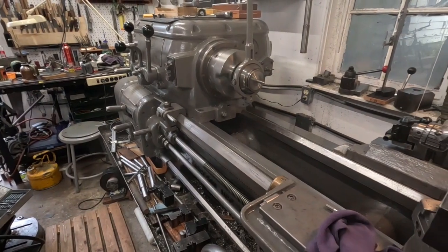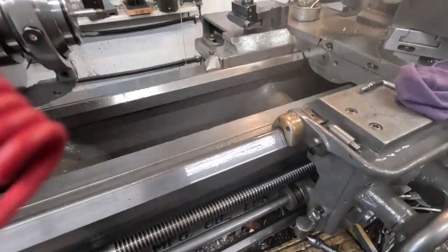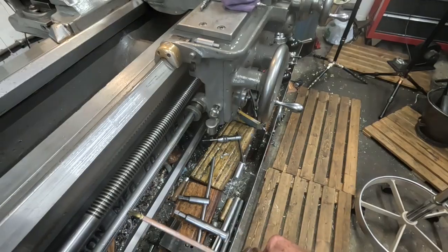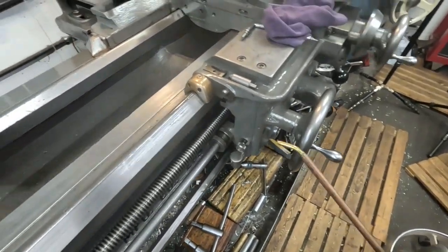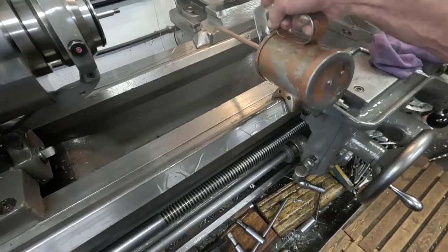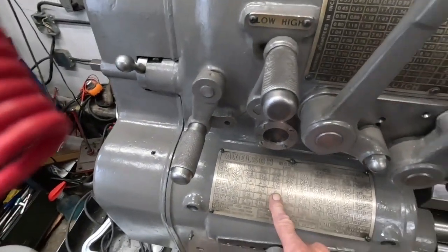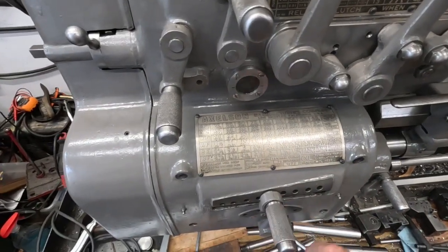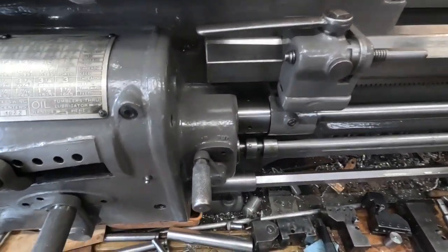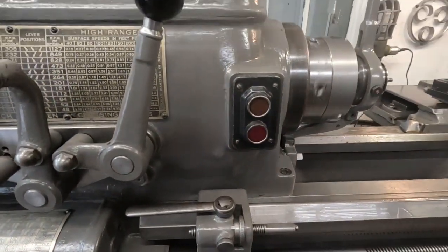Got this old machine oiling up on its own, and it needs a little bit of help too. I squirted a little oil on the lead screw and just a little bit of everything else that slides. The ways are oiling good, but I'll give it a little bit more — be sliding the tail stock in there. So I got this set here at 16 threads per inch. Looks good. Engage the lead screw — okay, that's engaged. You don't want to get your hand caught in there. I'll get set up and we'll cut a thread.